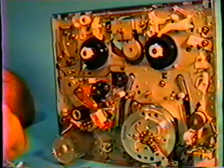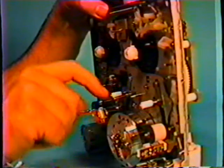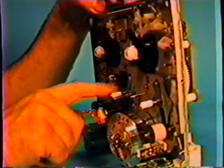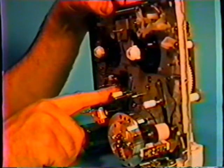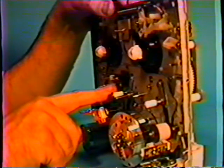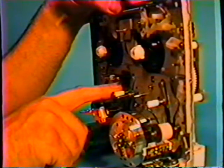I see. Yeah. These white, it's a white material. I don't know if you can quite see it. Now you can. There's a white material here, and on this one, they actually move. They're actually little nylon rollers that roll. Occasionally, you will find a unit where these rollers are stuck on. And when they stick, the tape does not run through the mechanism smoothly and will cause a problem in picture quality and in sound quality.